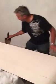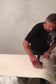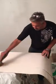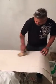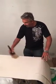And you don't have to prime the wall, that just goes straight on the wall? No, because it's a clean surface, emulsion, and I've rubbed the nibs off. But if it was very dry, for instance if you'd taken an old wallpaper off and rubbed everything down and filled it and rubbed it down again, then you'd Unibond it.